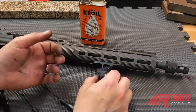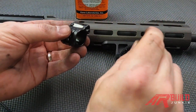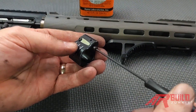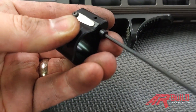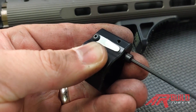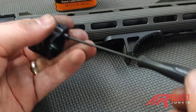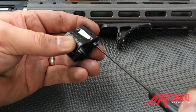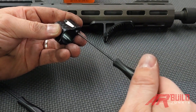This particular example is one I use in my classes — one of my preferred adjustable gas blocks, specifically the SLR adjustable gas block. These have click adjustments. Once you put the tool in, you can usually hear it like a scope turret being adjusted and you can feel a tactile feedback. We get good tactile feedback on this particular adjustable gas block. Generally you have about 14 settings from being completely closed to open.